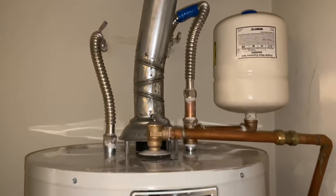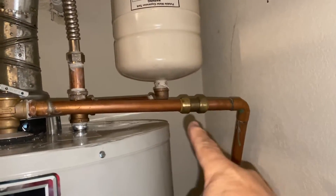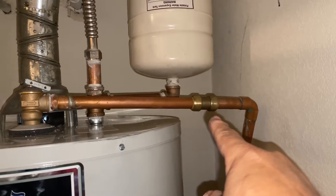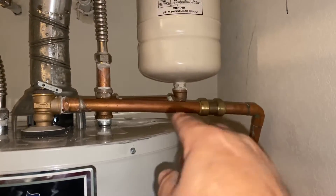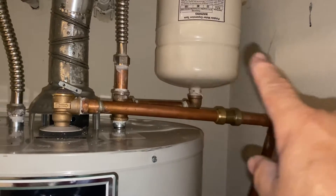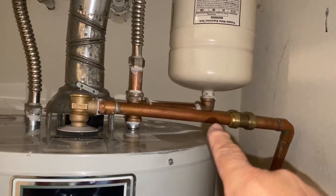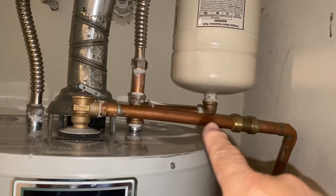So what we did is we got these new pieces here. I was able to join it with just one of those SharkBite couplings, and it worked. You know you could always cut, and if it doesn't match — if this is higher than that — you just get a flexible fitting and loop it like that. Then you use these SharkBite fittings so you don't have to solder, because soldering costs money.